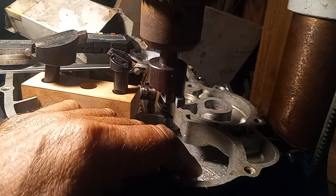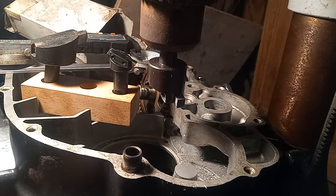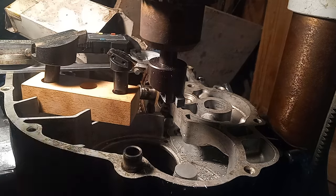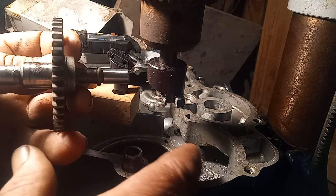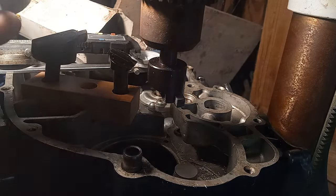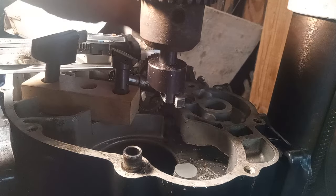Drilling a hole is no big thing. In fact, if I should accidentally go too big on it, I could very easily put a bushing in there, which would make more sense than running right in aluminum — but that's the way they did it. There's really no strain on there. This is the shaft that runs in that hole, but there's a big bushing that runs on the outside that supports it. So that's just really more of a pilot, and then there's another on the outside.